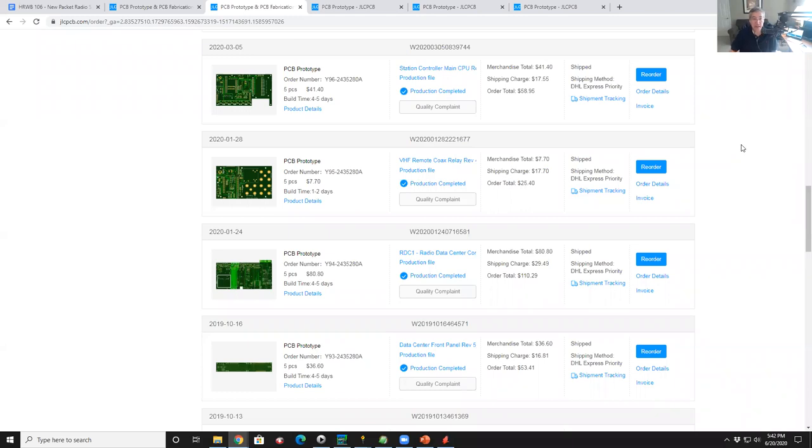So let's say you've got 2 identical circuits side by side. You could put a row of holes so you can snap it off, or you can do what they call a V score, where they grind in a 90 degree cut at 45 degrees on the top and bottom. It's a scribe line, which makes it easier to snap them apart. You can also route hot dog shape things with just a small number of connection points.